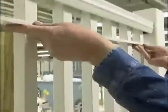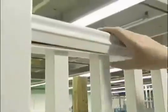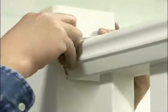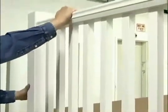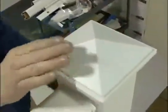Raise the baluster spacer and snap it into place. Place the optional gaskets on both rails. After the railing is secure, place the white rubber screw protectors over the screw points to prevent injury by hidden screws. Secure post cap on the post using a bead of silicone or PVC adhesive around the top of the post sleeve to secure.